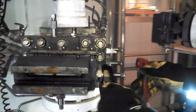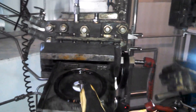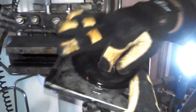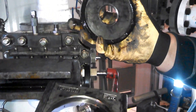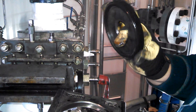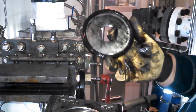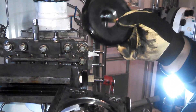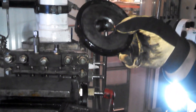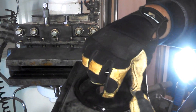Now that you're open, roll your plate out. This is a two-piece carrier — this is your orifice plate and the carrier. This has a rubber carrier on it that also comes with a Teflon; it's a two-piece Teflon carrier. Change to whatever orifice plate size you need. When reinstalling, make sure that the beveled edge is downstream of the meter.